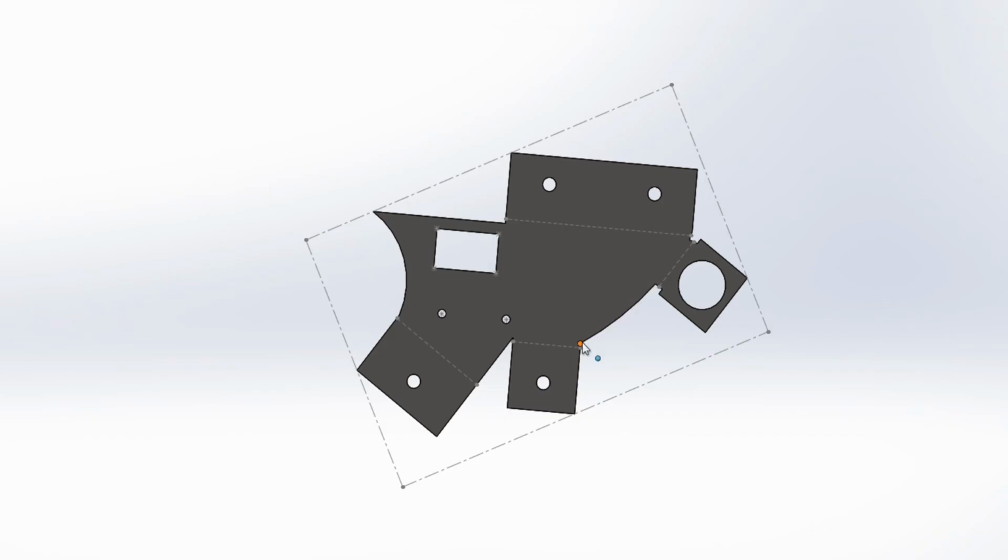So I had to put a wee bit in here, and you can't obviously put a fold on a curve. So I had to weld a bit in here, and also this curve I weld a bit in here. This hole is for the cable gland. The hole for the switch is a bit of metal that needs to be set in. These 4 M5 holes are for the mounting holes of the enclosure. These 2 holes are for the 3mm shaft, the wee extruded shaft that controls the switch or the timer to set the on time and off time of the actual pneumatic piston itself. So we'll unflatten this now and open the model up again before we move on to the transformer.